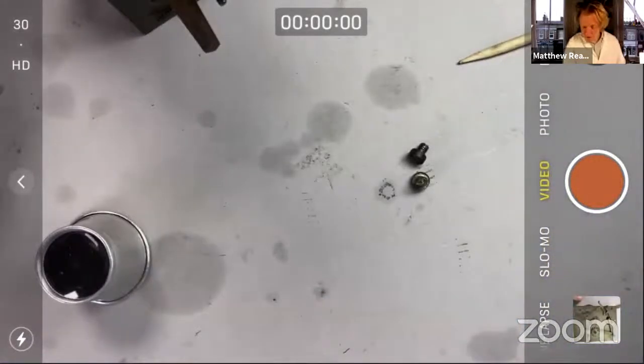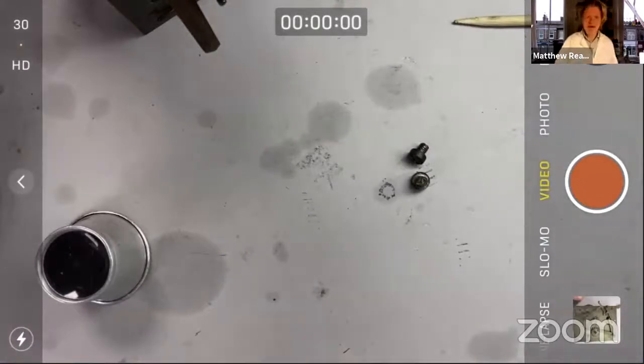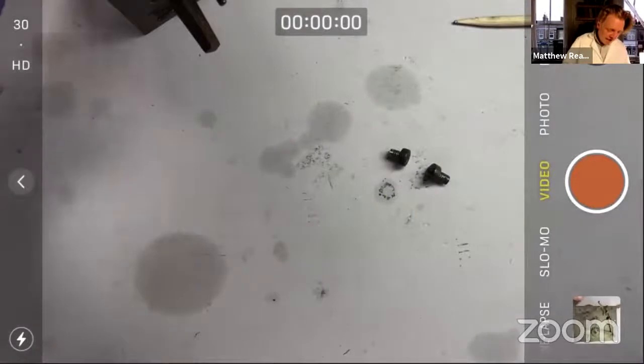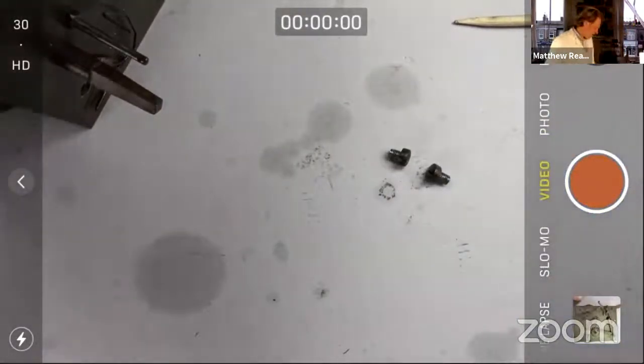Somebody, mentioning no names, I once had a bit of a run-in about hour bridges and back cocks that don't have steady pins. And I love a back cock that doesn't have a steady pin because, of course, you've got a little bit of slop there to adjust the external drop on this kind of escapement. And this other person said, oh, no, you should always drill them because it's going to move. And I thought, it's going to move where? Because in my view, it doesn't move. Okay, cool. Let's just tap these burrs down and that's done and out of the way.